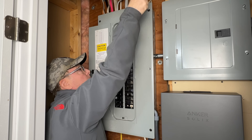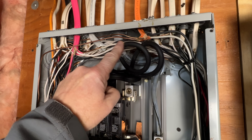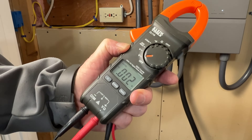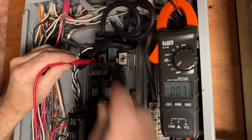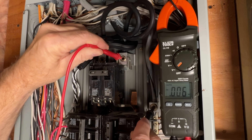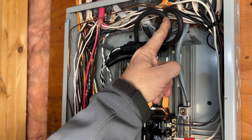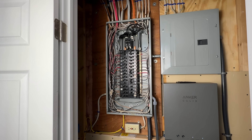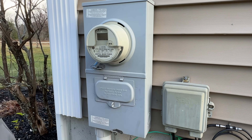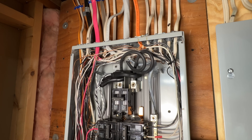This device needs to be installed at your generator ready panel or your manual transfer switch. The idea is to monitor power on one of the line wires coming in from your utility's electrical meter. The no-contact sensor is designed to wrap around one of the insulated line wires. With the cover removed, we'll use a multimeter to verify that power is turned off — checking line to line, line to neutral, and line to ground. Remember, it's not enough to shut off your panel main breaker. We also need the wires feeding the main breaker to be de-energized. Depending on your generator ready panel you may not have a breaker that isolates these wires. I have a breaker outside at my service for this, but if you don't, you may need to pull your utility meter. We're going to be wrapping the sensor antenna around one of the line wires so we need them de-energized for safety.